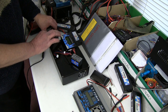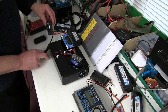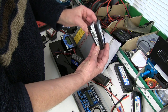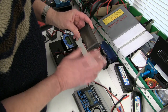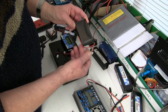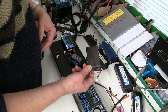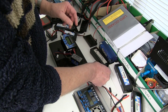Here's one that's been on this discharger for several hours. It goes down to zero and it's swollen up quite a lot. These bag sacks can swell up a lot and they won't burst. Is it safe once it's fully discharged? Yes — once you've taken all the energy out, it will not catch fire if you puncture it, and it's safe to dispose of in the dustbin. However, if you leave any energy in it at all, even a tiny bit, you will get some smoke if it's punctured.